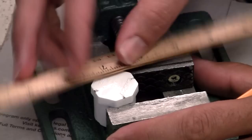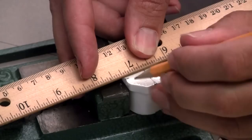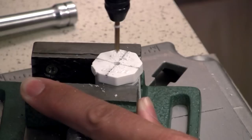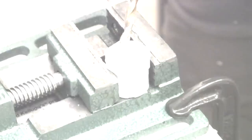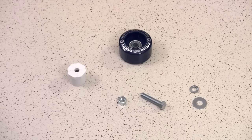The next item to prep is the eight PVC plugs - 3/4 inch plugs with holes in them. The plugs from Lowe's are a little stop-sign shape or octagons, so you can easily find the middle by putting a mark in the middle of four edges and drawing a criss-cross to the center. Then drill a pilot hole at your drill workstation so you know where the center is. Then take your cordless drill with a larger bit - first a quarter inch - and drill out that pilot hole, then change to a 5/16 inch bit and drill that out. That'll give you the desired hole size. Do that seven more times.